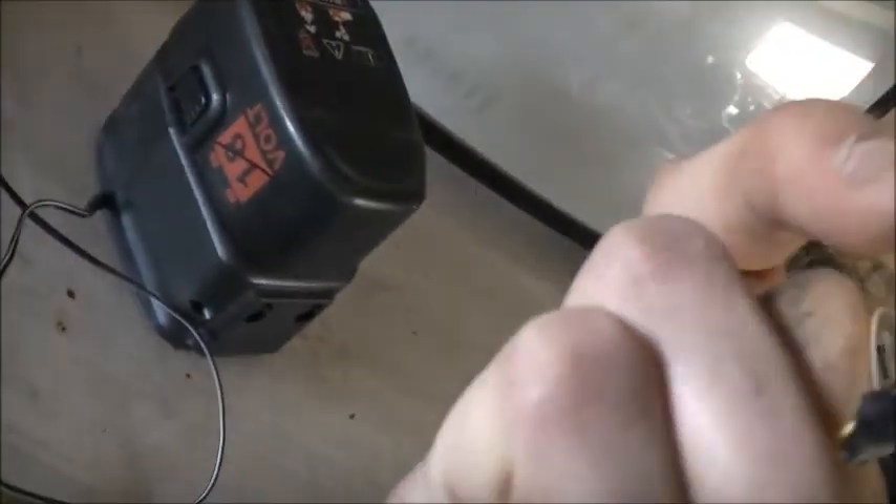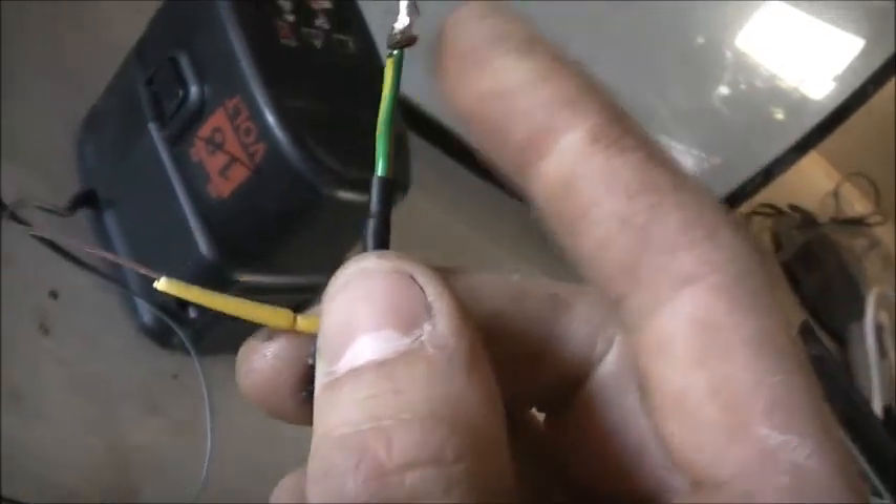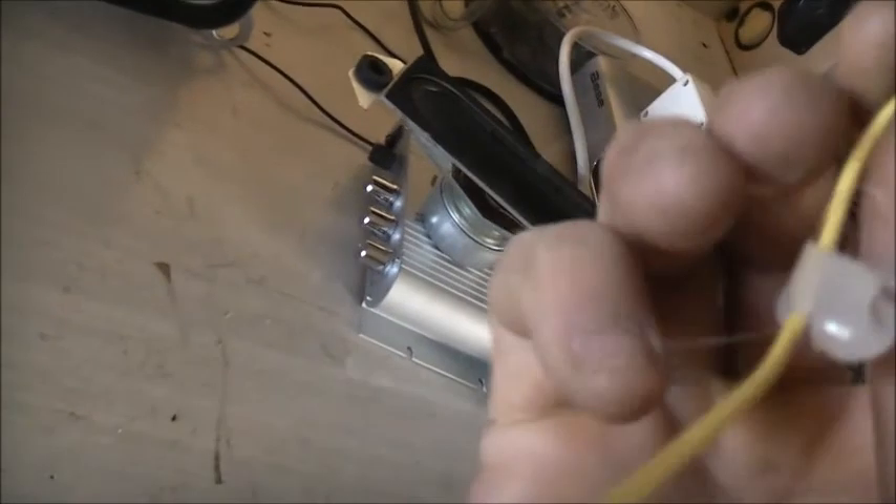The wiring is actually melted here. That wire was severely underrated. This wire here has more rating than the wire I was using - that was only about a 12-volt wire from an old computer power supply. Same gauge, but very insufficient amount of copper.